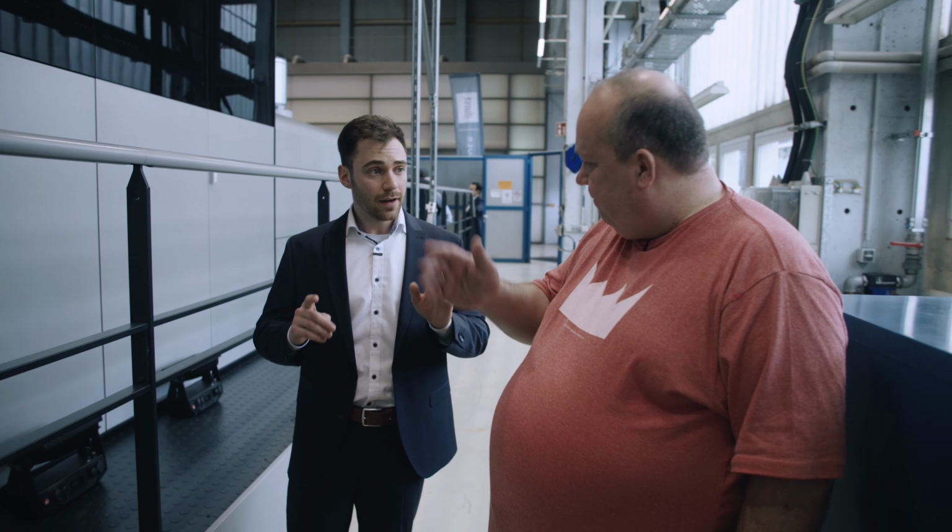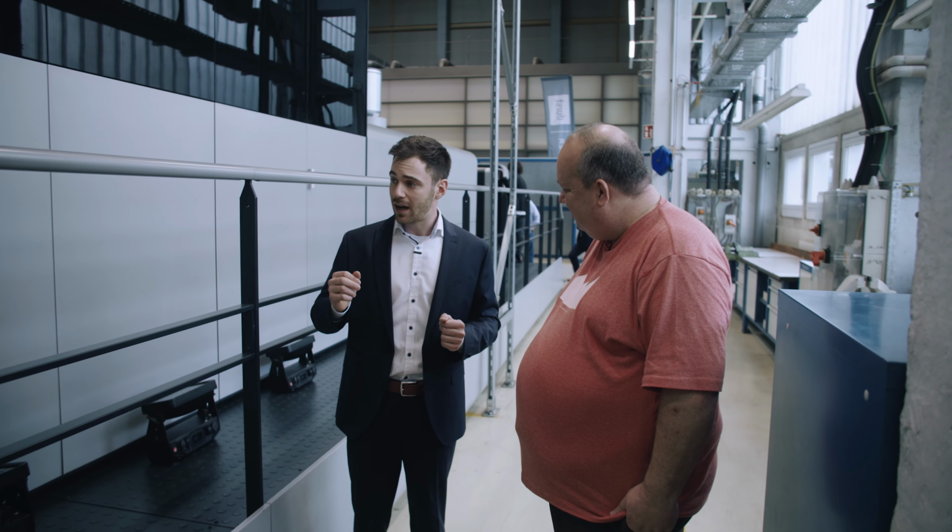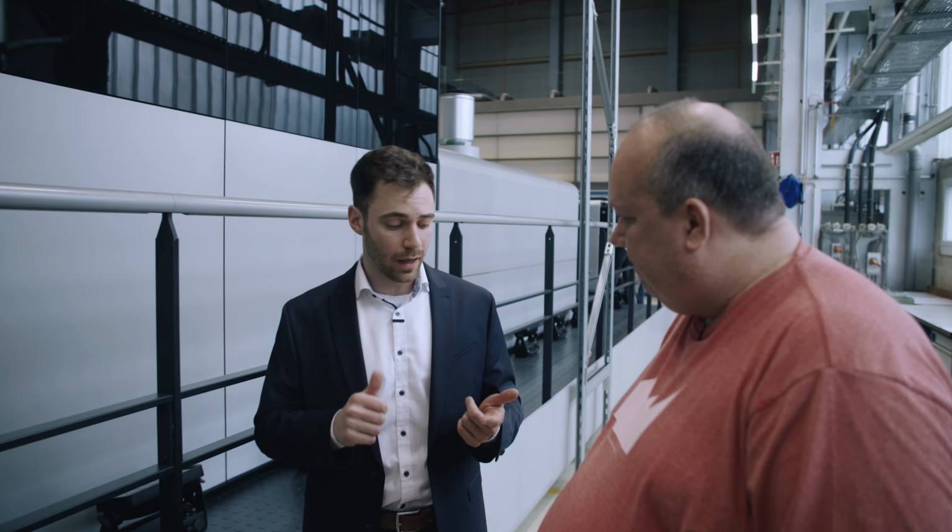So another thing about this unit, which is very unique in the market, I think, is our inline camera system. Our inline camera system is developed by Durst, jointly with Koenig Bauer Sheetfed and Koenig Bauer Banknote Solutions. Okay, they should know, right? We've also got expertise here from the banknote solution systems, and this system is able to detect every missing line we have in the print and to compensate it on the next sheet.